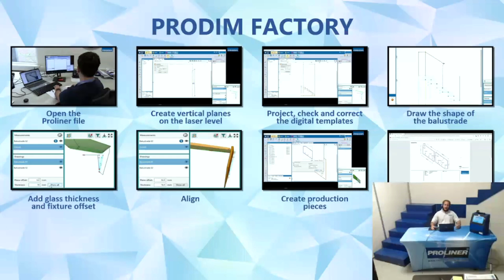We will then finally align our shapes and get the final pieces we need, called production pieces, which we will then publish out as a DXF file ready to be sent to any CNC machine or even hand cutting machines as well. We can even publish shop ticket reports and files to then be printed or emailed to go along with your job process.